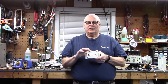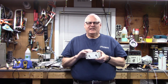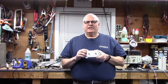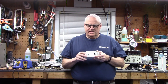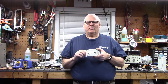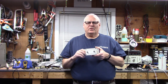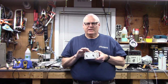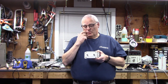This is going to essentially put a resistance in series with the outside of the coax, not the inside — there's no loss, or it's minimal, in tenths of a dB. Any noise that's generated in the house and wants to propagate out to your antenna is going to be reduced by this. You need one here in the house and another one out at the antenna, especially if you're running an e-probe antenna.